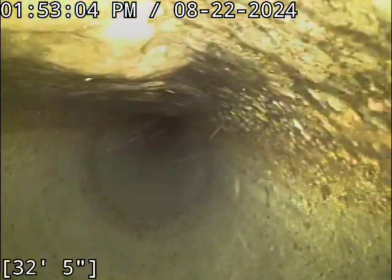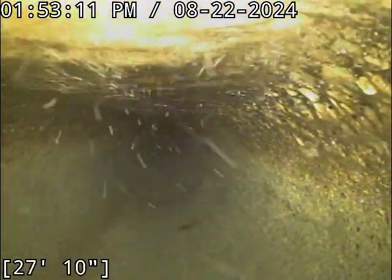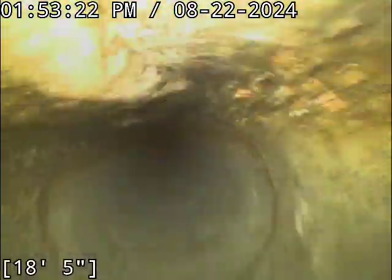So given the fact that we Y connect into the top of a line and we don't have continuous pipe, with 90s at the base of that drop, that tells me that it looks like we're dropping into a line that likely originates from uphill. So this is likely city main here. But you'd have to check with the city. It's just an odd arrangement. It's a hard one to discern.